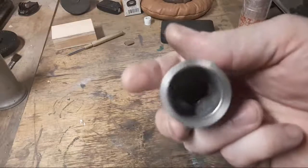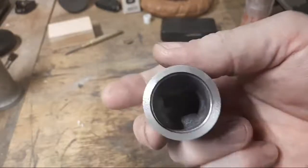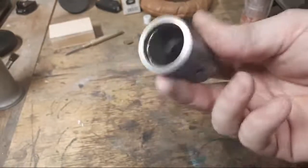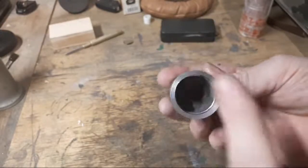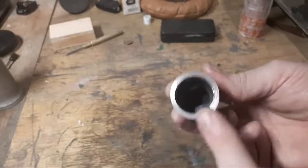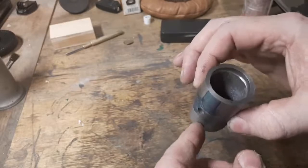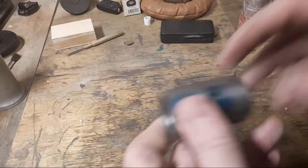We've got a hole somewhere through the centre, which I'm really impressed about. That always impresses me. And it's awesome because it's a very difficult thing to do because you can't see inside there. I actually did upside down the rotary table in the end, and I got this line somewhere across the middle or perpendicular to the lugs, and it's in the centre this way. So hopefully that's pretty good.